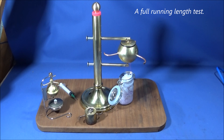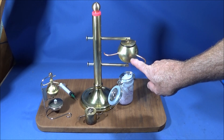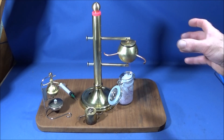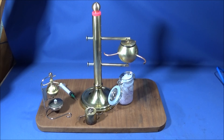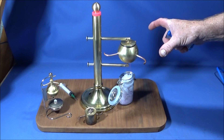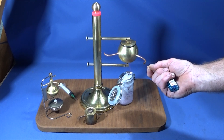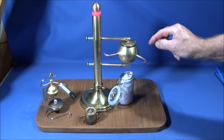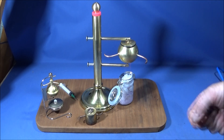The water level is about up to there, just below the actual pipe, so it's quite a weight of water in there but it still works perfectly like that. When I made these copper pipes they've obviously got to be exactly the same length. All I did was squash the ends in here on the vice and sucked on them with my mouth, each one, to see that it gave the same sort of resistance.